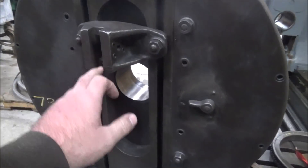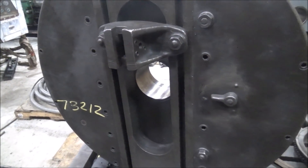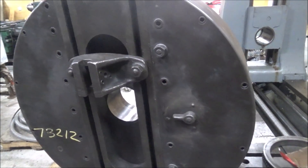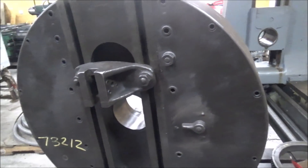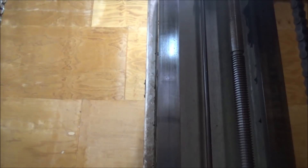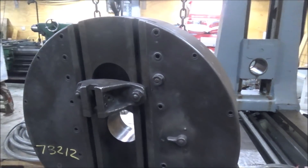This is the boring facing bar that goes on it. You use a long bar or a short piece of tool steel in here on the facing attachment. This thing is 24 inches in diameter, so it can face up to 48 inches total — really more than that if you run the tool out off the end, but that'd be getting pretty close to the limit on this machine. You'd have to be able to swing that, and with four feet of column you can get way out there if you had to — basically a big giant fly cutter.